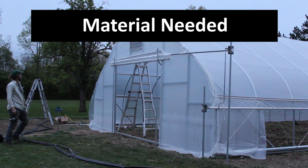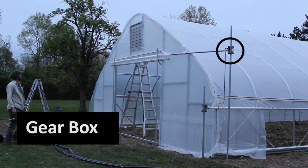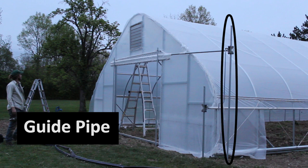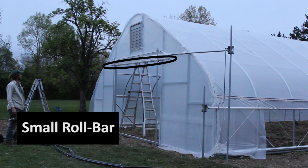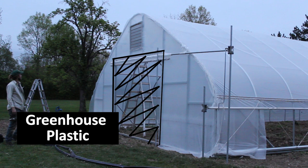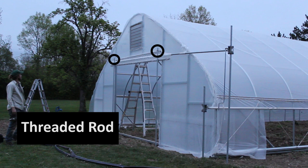Now let's take a look at all of the materials we need for this installation. I'll have links in the description to where you can find them. You'll need one gearbox — this one is a left output, even though it's on the right. You'll need a guide pipe or guide post for the gearbox to go up and down on. You'll need a large roll bar — it could be one piece or two pieces depending on how wide your opening is. You'll also need a small roll bar which goes underneath it, and a piece of plastic that will cover the opening. You'll need anti-billow tubing to hold the roll bars in place in windstorms, and threaded rod that can attach the anti-billow tubing to your structure.